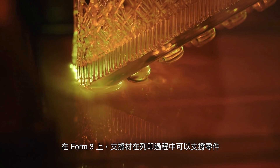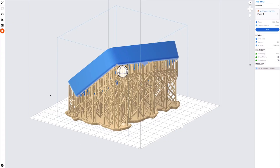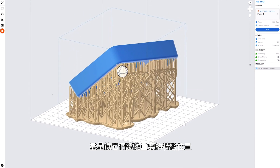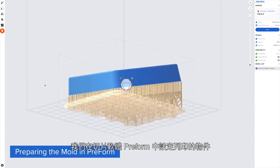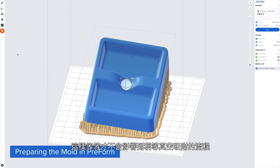There are a few tips and guidelines that you'll want to follow when preparing your mold parts for 3D printing. On the Form 3, support structures are used to support the part during printing. While these support structures are minimal, it's best to keep them off the critical surfaces to reduce the amount of post-processing required. We've set up our mold parts in PreForm to have supports on the underside of the mold, where it won't affect our vacuum forming process later on.